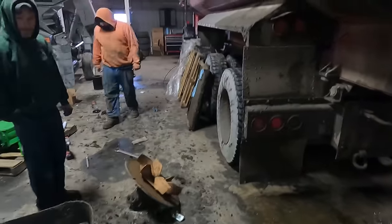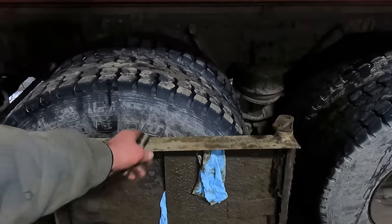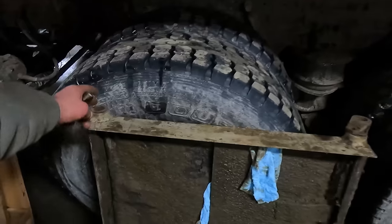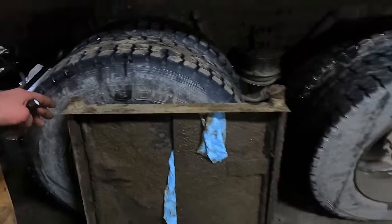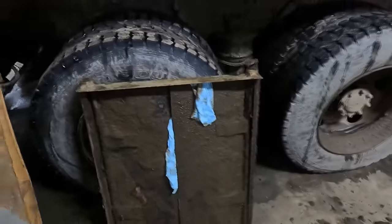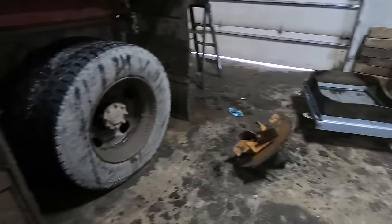And the other thing they're putting on is they're replacing the load hatch doors. They've got the old one off here, and then they've got the new one that goes on. This one was all worn out. There's an air cylinder. This is the back of it. There's an air cylinder on there that closes these flaps together, and the tab broke off this one side. Once you open this air cylinder, it flops these doors down so that the manure can be loaded in the tank. That's in the closed position now. That keeps the manure from coming out.